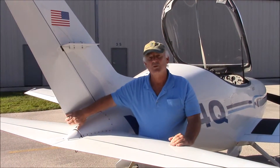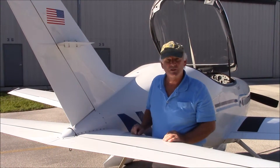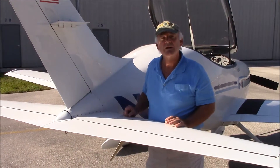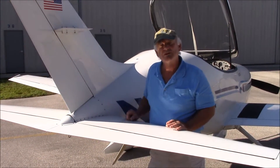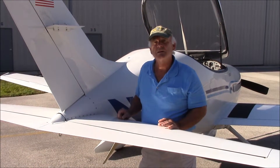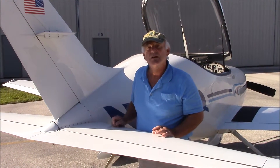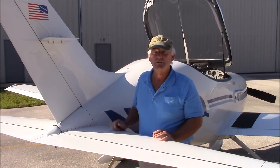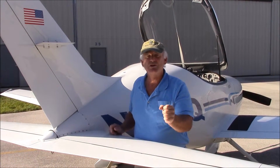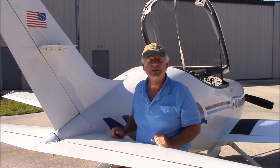It's much nicer on takeoff roll — I'm not pushing against a big spring-loaded cartridge. In an experimental airplane everybody does something a little bit different, but I have electric trim for all three axes: electric trim for the two surfaces, the yaw damper, and essentially a third electric trim. I have the pulse width modulator that runs it, but in the event of an emergency, I have a third battery that controls the emergency backup and a spare way of bypassing the pulse width modulator. I can also run the electric trim with a toggle switch in the cockpit so if I had to land without trim, it would be able to take some of the forces out. The truth of the matter is, no matter where the trim is located with the spring loading against it, you can always go past it just by pushing farther on the controls — you would never want your trim system to get the controls to a position where you can't force it out mechanically.